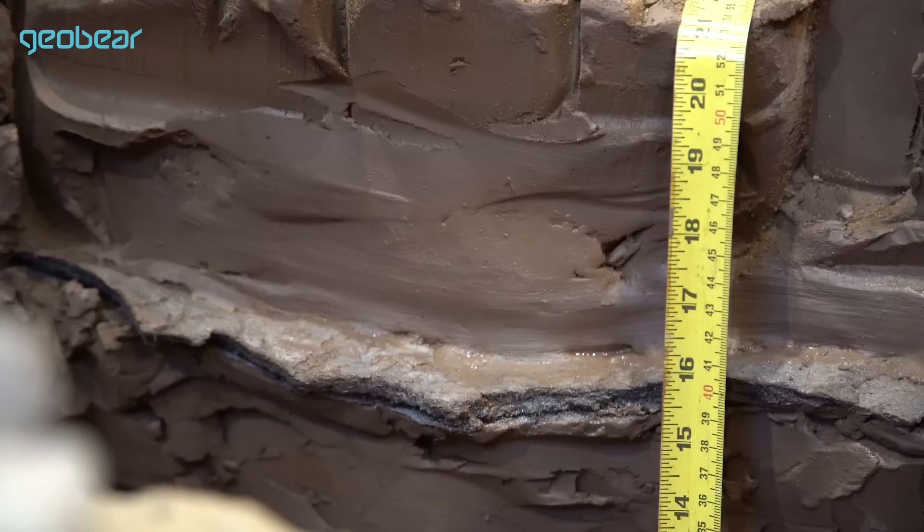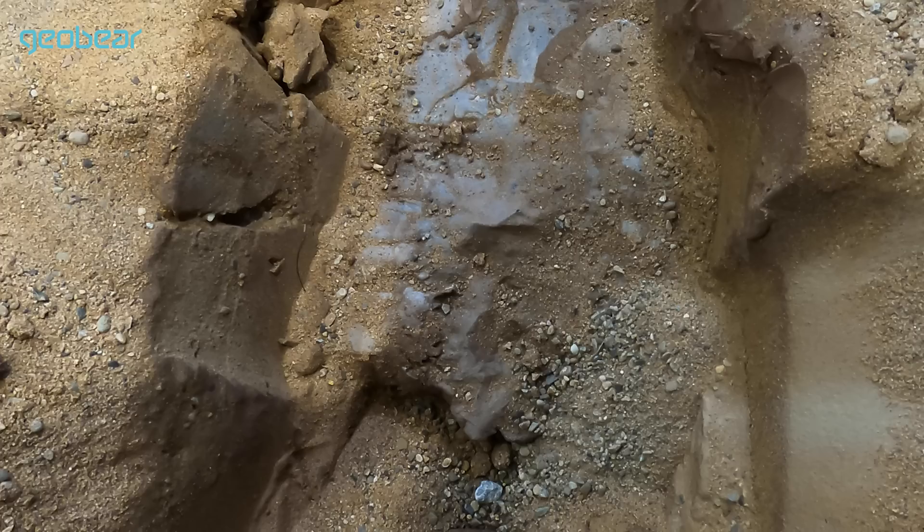As the chemical reaction takes place, this geopolymer expands into a very tough, resilient material and adds something that the clay doesn't have. The clay can shear very easily, but once we put this geopolymer lens — or several series of lenses — within the clay, it stops the shear planes developing.